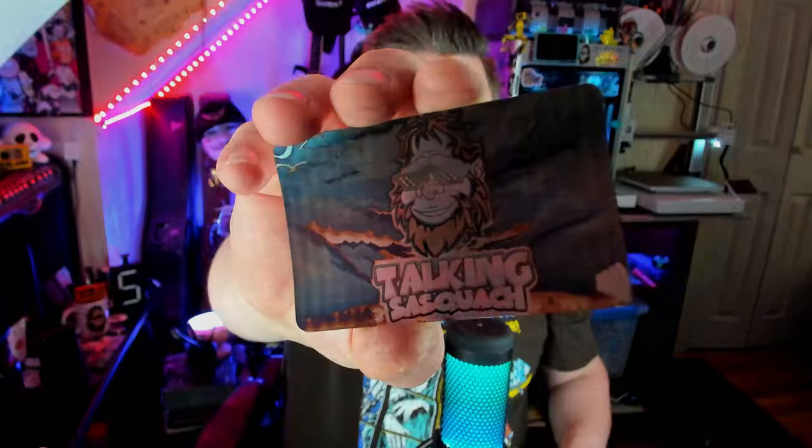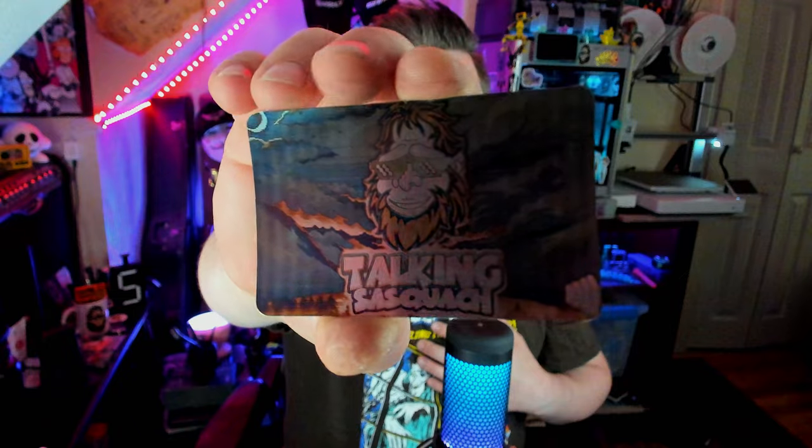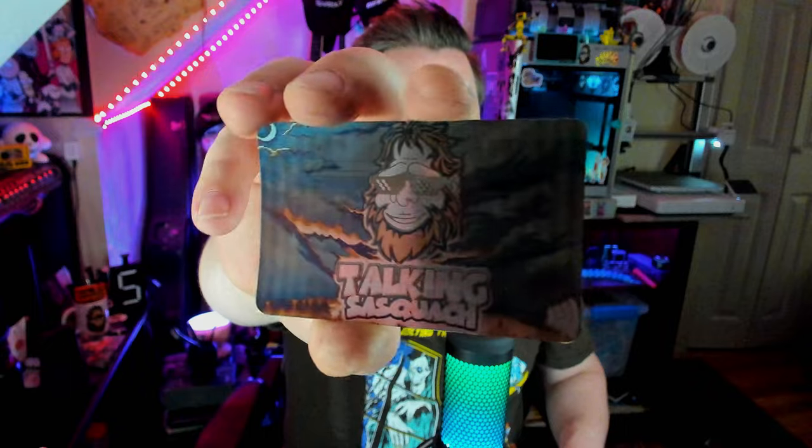So then I went ahead and ordered these two-inch stainless steel coin pendants. I made this guy too — it's got 'Talking Sasquatch 2024' and says 'Don't be a skid.' These things are so cool — I'm so proud of these. Here's another fun thing that didn't work out exactly as I wanted, but was still fun to play with. I picked up these stainless steel credit cards — about 0.5 millimeter thick stainless steel — and it was a little thin, so it warped. But as a proof of concept, they came out really cool. I had designed a credit card for NFC stuff and decided to print it on the stainless steel business card. The annealing process made this thing look so good. Then I tried a coaster that came with the machine. I need to adjust the levels a little bit, but I think if I run the laser at a little lower power and a little faster, it'll look even better — and this was my first try.